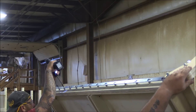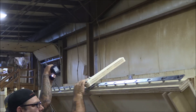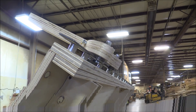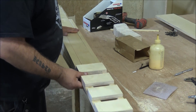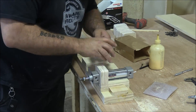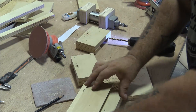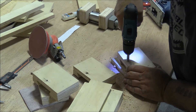This system with 1/8-inch steel and V-groove bearings works really well for slides if you're ever trying to rig one up yourself. This whole project was completed for well under $300 — hovering right in the $260 to $270 range. That does not include man hours, but total man hours came to about eight hours, which is a far cry from the $3,600 to $4,000 that these pneumatic clamping table systems start at. All the pneumatic clamps were purchased off Amazon and I'll provide links below, including fittings, hose, and basically everything you need for your own clamping system.